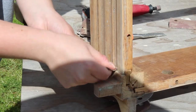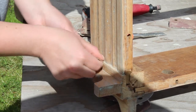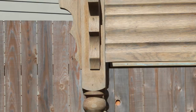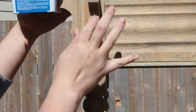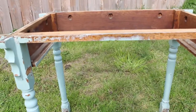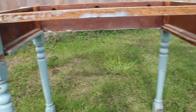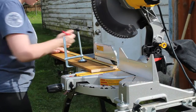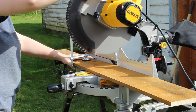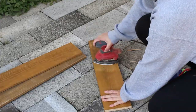As I stated earlier, both methods never completely get rid of all the paint, so you're always going to have to come in and sand afterwards. I used 240 and 180 grit sandpaper and hand sanded in all the little details. After I was done sanding, I went in with some wood filler, filled in any imperfections, and sanded it smooth once it was dry. This little table originally did have a drawer at some point, but it's no longer part of it, so instead of leaving that space empty I'm going to turn it into a little shelf. I got some cedar fencing off Facebook Marketplace for free, measured and cut three pieces using my miter saw, then sanded them smooth with my palm sander to get them ready for stain.